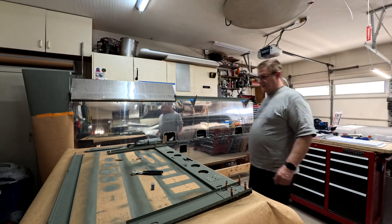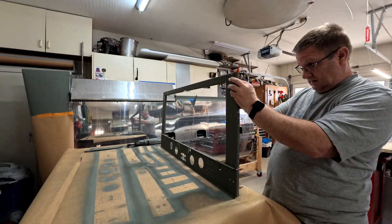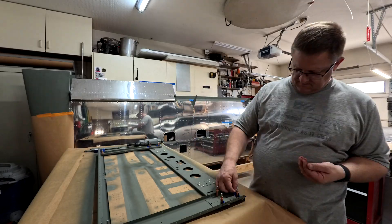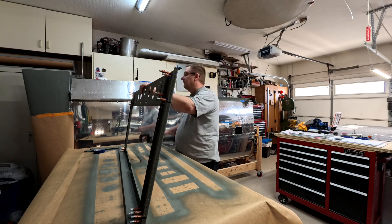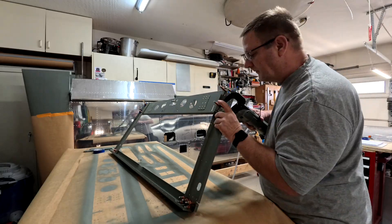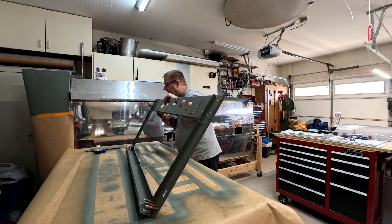Depending on which way you're facing, it's behind it if you're looking from the front, but it's in front of it if you're looking from the back. You don't necessarily attach that top piece right now — you just click it in so it holds things square, and you attach the extra brackets. That is where your rear wing attach point is — there's that one pretty thick aluminum piece where the rear of the wing actually attaches to the reinforcement holes. Then you just rivet it together — it's not too difficult.